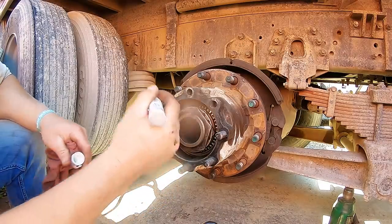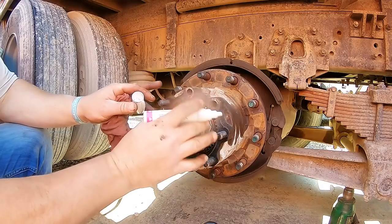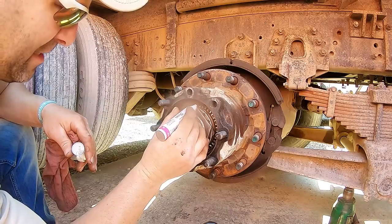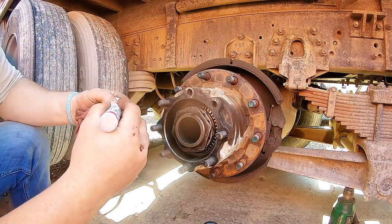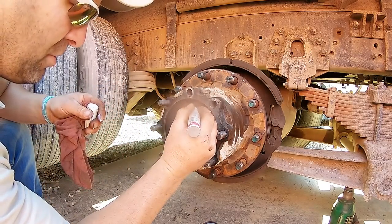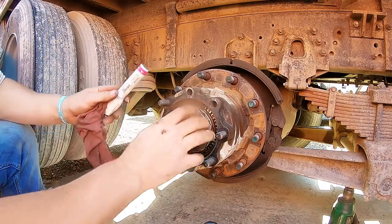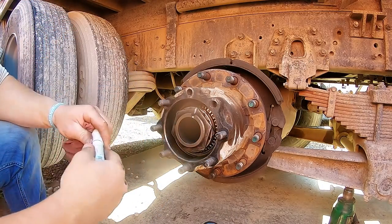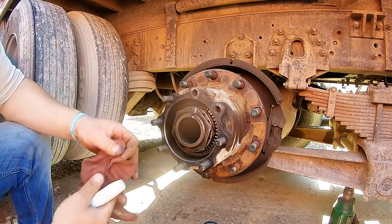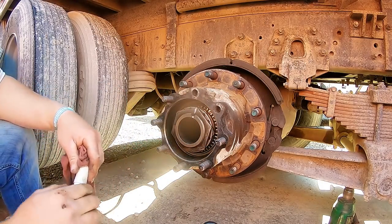So what I like to do, even though you still torque down your bearings and torque everything the way it should be, just put a little paint mark, you know, at your axle. Try to put a paint mark. Paint might be out of paint. Just so you know, you got everything torqued somewhat, because this nut will spin. And then you're still gonna torque it, like I said, and you play with it till this has no play, but at least gives you a reference. If this is way over here, then you know, hey, let's double check something.